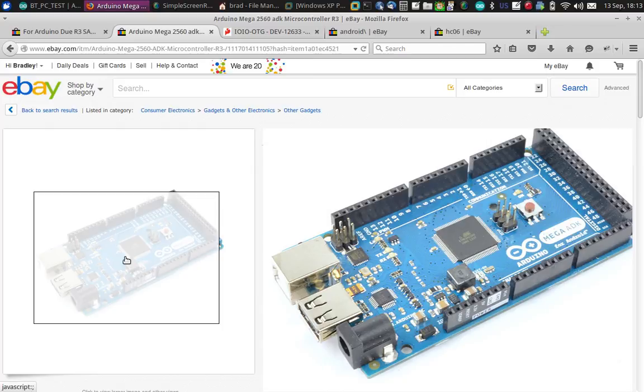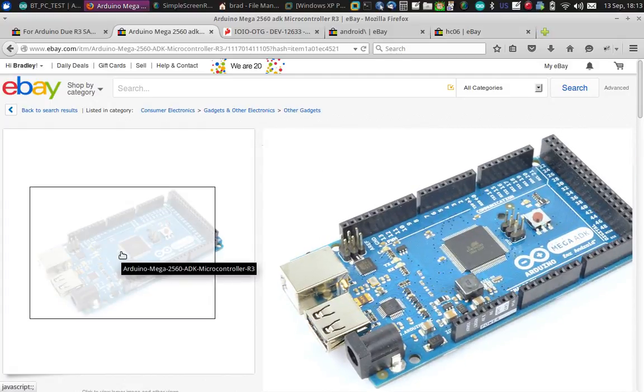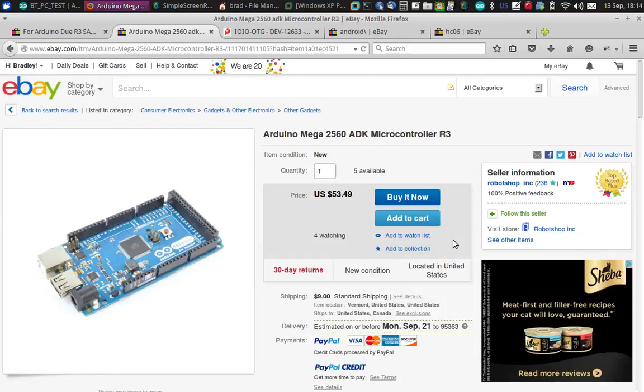Arduino board with a USB host shield. So any Arduino board with a USB host shield could behave the same way. The Mega ADK board essentially has a USB Type A connector connected to a chip that operates as a USB serial port, and that's how you connect to your Android phone. The Mega ADK acts as a USB host, transferring information via serial to your device and also powering your Android device. So this board was pretty nice, however it is relatively expensive at $53. You could probably buy a Mega and a USB host shield for cheaper than they sell these boards.